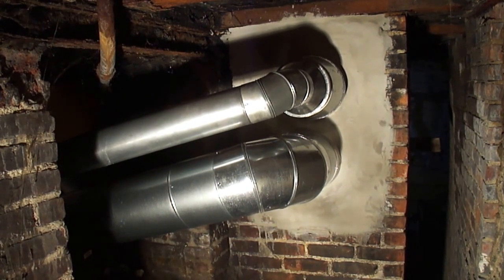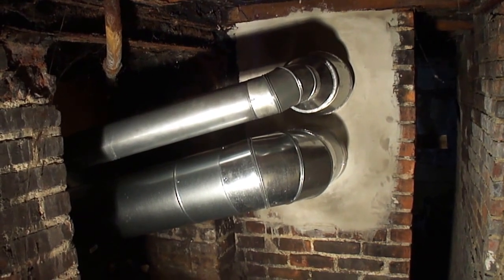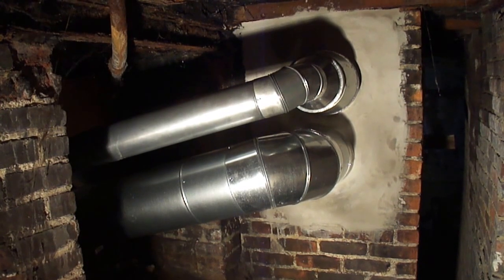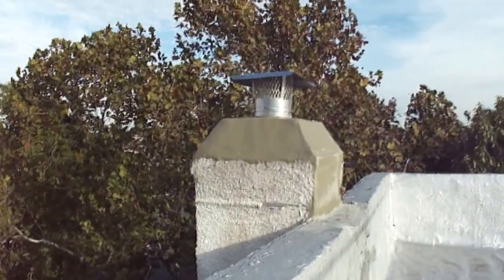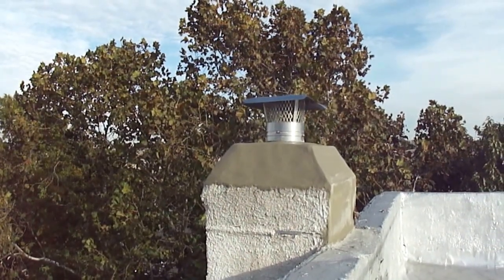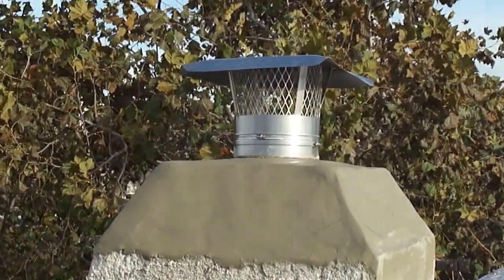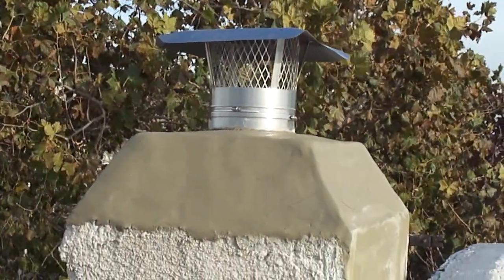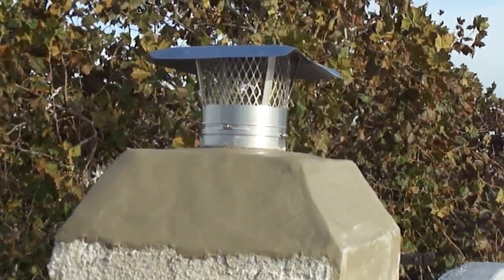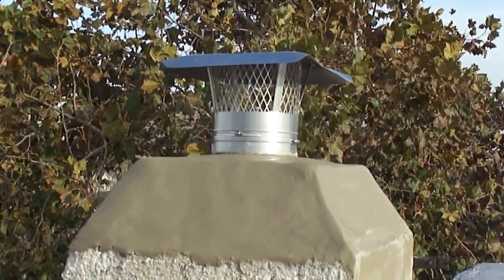This one is 10 inches in diameter at the bottom and on top it's 5 inches. The bottom is for the boiler and the top is for a hot water heater. We're showing you the top of the chimney with the liner rain cap and also the corners re-cemented so that rain, moisture, and dirt won't enter it. A job like this will make your chimney last a lot longer.